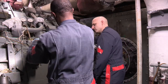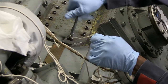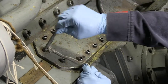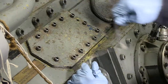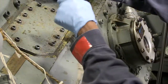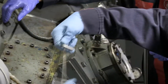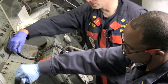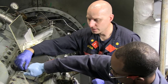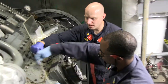We're tightening 12 bolts - however many there are - it's tedious, and it's made even more tedious by the lanyard. You've got all this manpower down here with one sailor turning a wrench, and it's pretty easy for everybody else to get casual and forget the environment they're in. Until every bolt is torqued down, until everything is removed from the containment area and inventoried, the environment you're in is one where your MRG is open. As you see people start getting casual, ask them to step outside the security area - only people with a direct hand in what's going on should be involved.